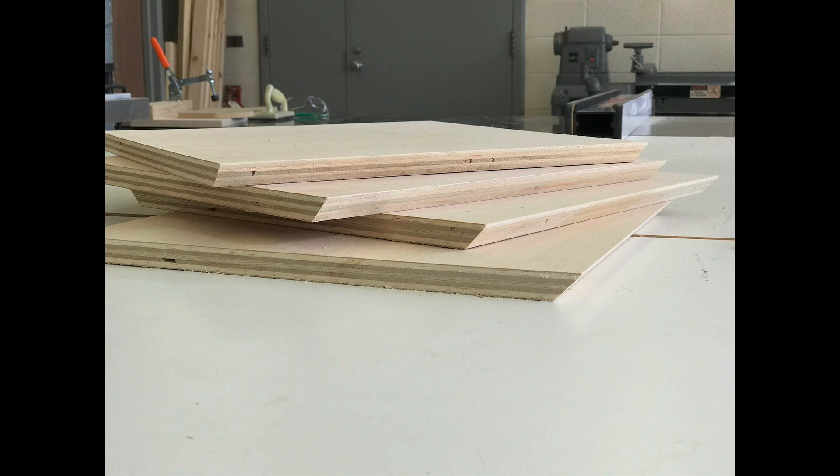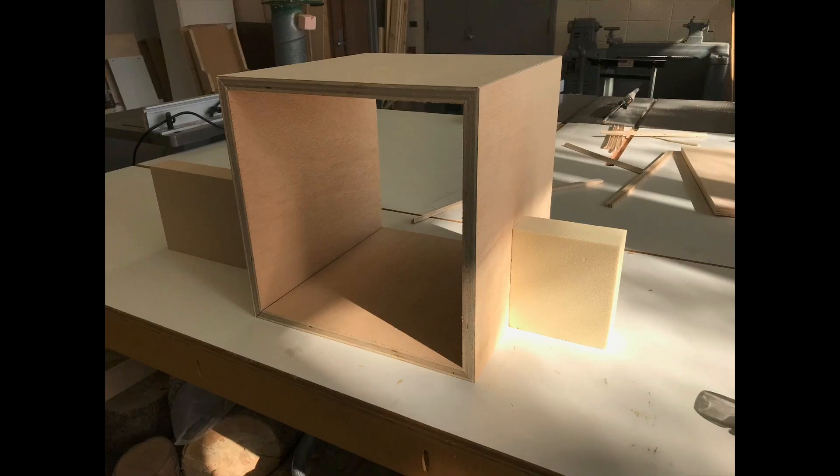You see that I do not adjust the machines per board. I just try to figure out which cuts I need to do, kind of like in mass production, and then just do one task and cut multiple parts. This way you can prevent any inaccuracies, because even a millimeter in woodworking is a millimeter — you will see this later.